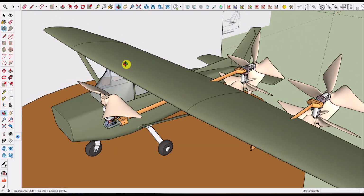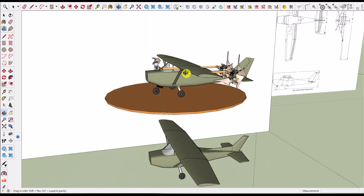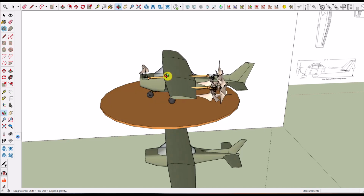And the pump that you need, again, is the VP1-130, the variable displacement pump. In addition, the Parker-Hannifin VP1-130 pump and the Parker-Hannifin F1260 pump, because you need a high flow system to get it to go straight up in the air. But once it starts flying, again, you rotate this down. You only need 60, maybe 80 horsepower to get this thing to fly through the air.